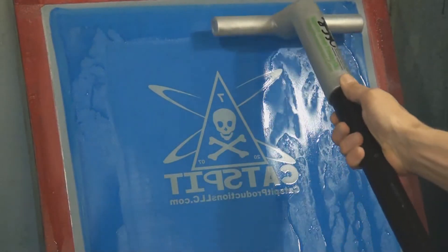So on this type of unit, that would be the inkwell side. We have a couple techniques to deal with that filming or scumming. But I've found that with this unit, my exposure time — I'm at about 10 seconds, believe it or not — with Sodicam Textile PC Blue. And the filming and scumming is practically non-existent, very little to none. So the wavelength is dead on and it's curing the emulsion through the entire layer from bottom to top very well. It's almost too good, and you really want a really good film positive for working with this type of unit.